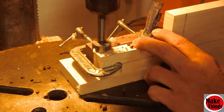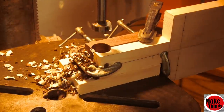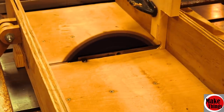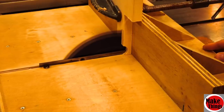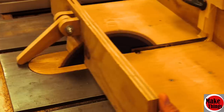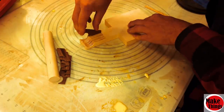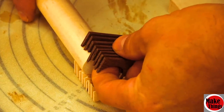With my newer model I decided to make the overall jig much thinner, with a thicker center that would house two knobs instead of just one, with two studs. I wanted the horizontal featherboard to be easier to see below the fulcrum and didn't want to have to thread it through three bolts. With my box joint jig I made splines in the featherboard pivot and cut the walnut into splines before gluing them in, using a one-inch dowel as a placeholder.